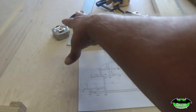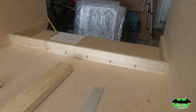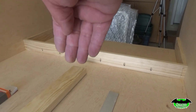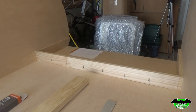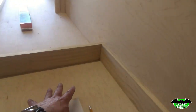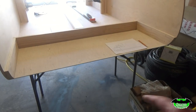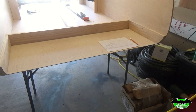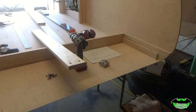That will give us basically a box in here, which a floor will go over, and we'll have two compartments. With any luck you have your backboard on — I used pocket screws. This is going to be covered by the 3¼-inch bulkhead that's going to come up and support the counter. That will be the inside of a storage area once we cover it and put the lids on. The piece that goes across here should be about 45 inches wide.